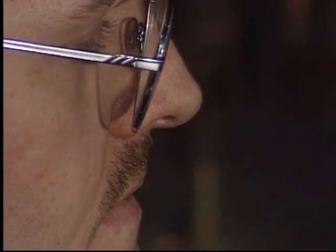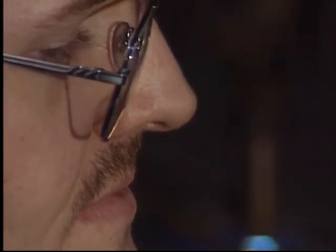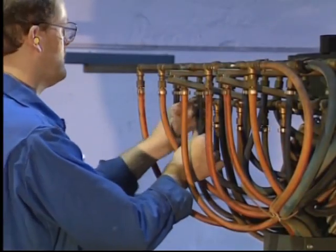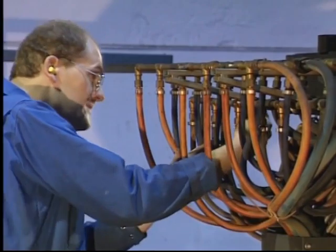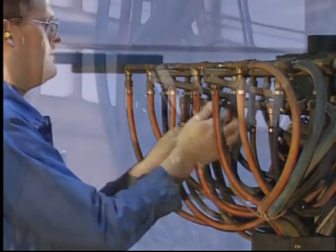The strong smell of acetylene and thermaline warn us of leakage. But by the time we become aware of it, it may be too late. This is why you must check your equipment carefully. A visual inspection reveals hoses which have begun to dry out and become dangerous. All hoses dry out with the passage of time and must be replaced sooner or later.